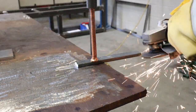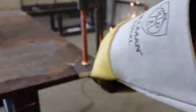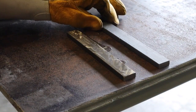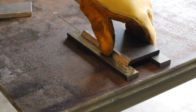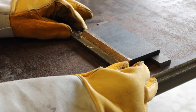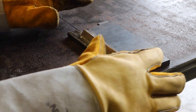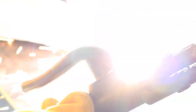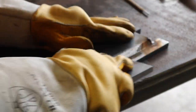Make sure you grind the backing strip — one side, and I grind the whole surface. Hit all of the V-groove bevel, including the top and bottom edges, to remove any dross. When tacking up the V-groove, take an extra backing strip and set it on the table, lay your ground backing strip next to it, then lay your plate on top — about a quarter inch in — with about one inch runoff tabs on both sides. Tack the front end and back end with small, light setup tacks.